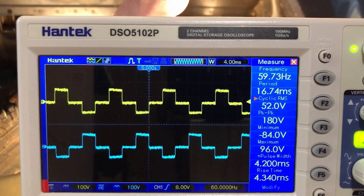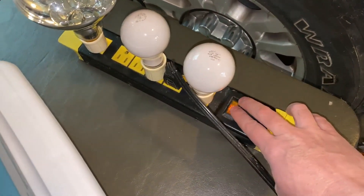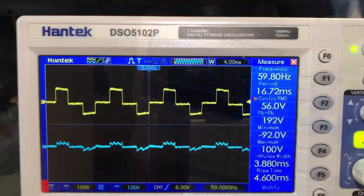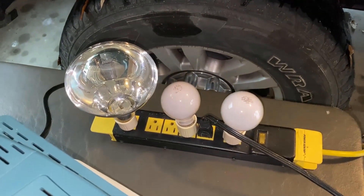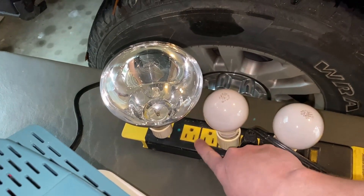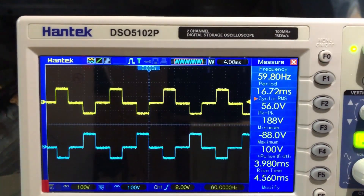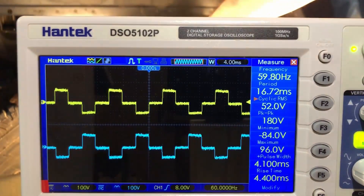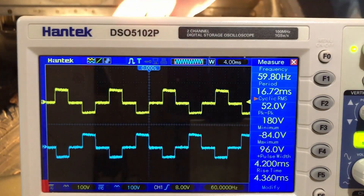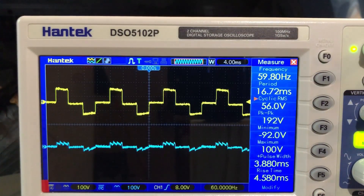One thing I don't like about having the voltage split across two legs like that: if I come over and turn the surge protector off, I still have 56 volts on what should be the neutral. The surge protector only breaks the hot — it doesn't break the neutral. So even with the switch off, the larger slot on every outlet still has 56 volts on it. I don't like that. When I turn the surge protector back on, we see the hot leg light up like it should — but with the protector off, that's a problem.